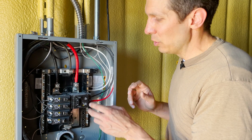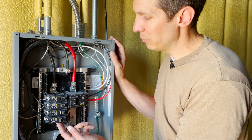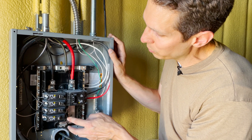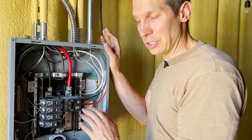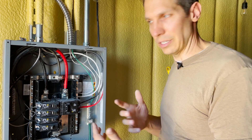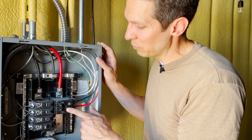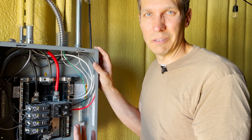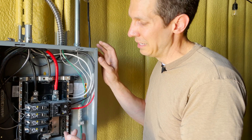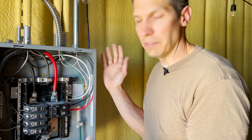And that's really it. You need to make sure you have the right circuit breaker — if you have one that only has one spot it's not going to work for 240 volts. You need something that accesses both sides of the incoming power. You can get 240 volt two-pole circuit breakers in 50 amp, 40 amp, 30 amp, and 20 amp sizes. I'm hoping to get a dust removal system in here, so I'll probably need to add a 20 amp 240 volt circuit in this box eventually.